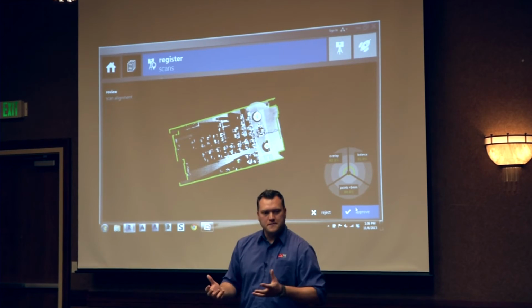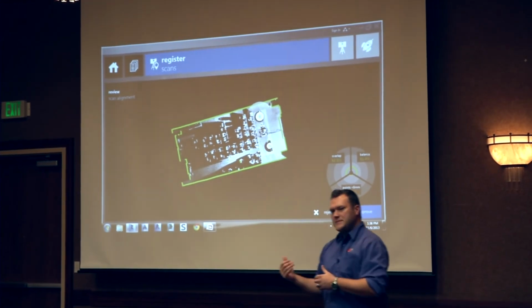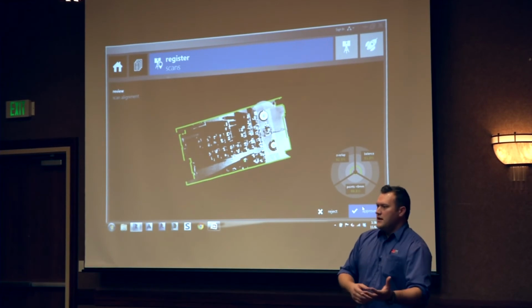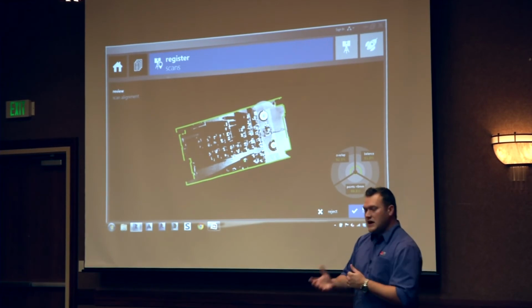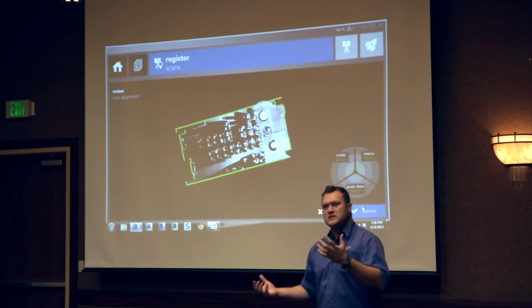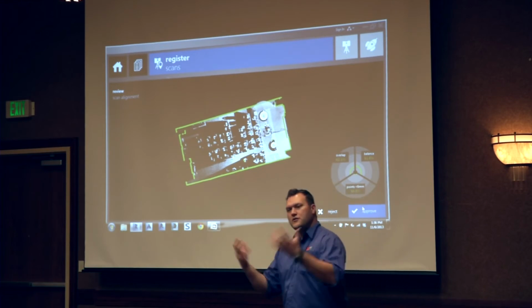So what do we do? Typically, you'd have to bring targets back out and maybe even rescan because you took down your targets from before, and you don't have points of reference. With this software, you just revisit the site and put one scan position right in the middle, right between those two positions. And then you're merging all three together.